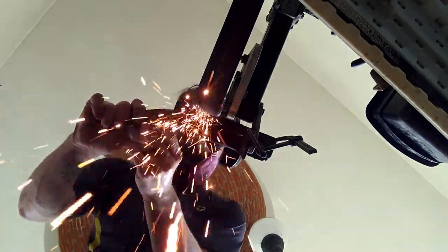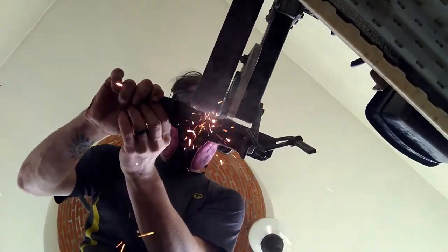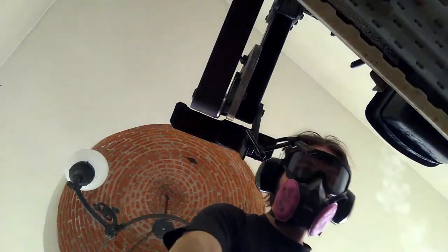We've cut it out. We're going to use our flat platen on whatever sander you have and cut anything that isn't the razor away. This is going to be the two-dimensional shape that you have in your sketchbooks, drawings, or templates. Just get it to that 2D shape — this can be done pretty quickly. You can use quite a bit of pressure here to get this thing done. I'll give you a couple of different shots of what that looks like.